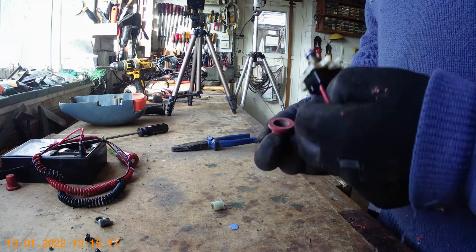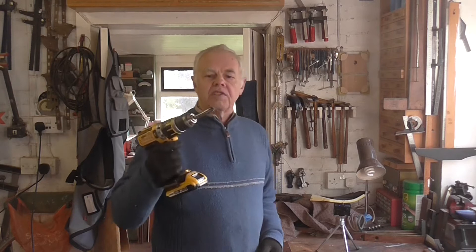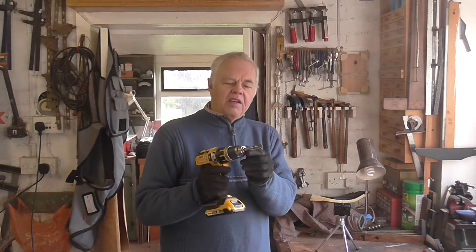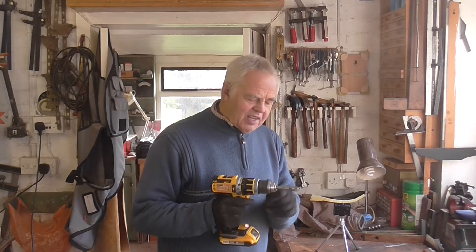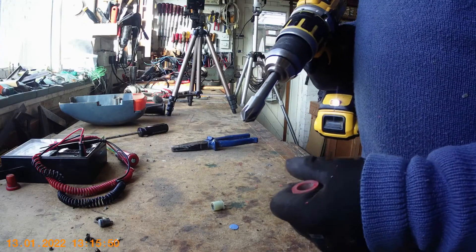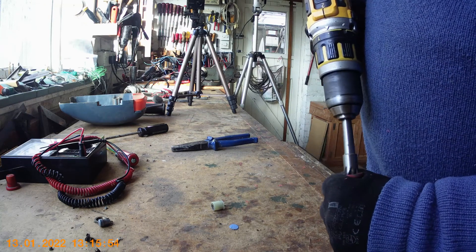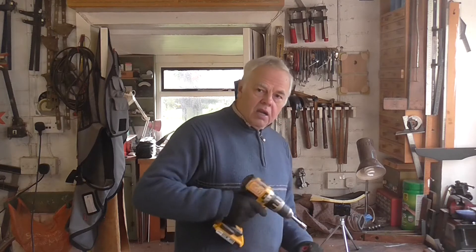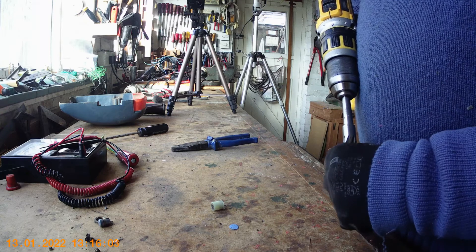There are two ways I can do it. I can make that hole larger — it's not easy because the drill is going to be a bit ferocious. I've got this oversized countersink bit; it doesn't fit in perfectly because it's a tapered fitting, but it will fit in there and it'll be good enough. So I'm going to gently ream that hole out, just using it as a reamer to make it a bit larger.